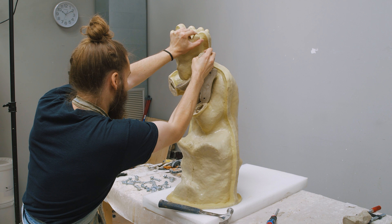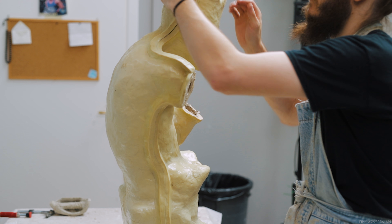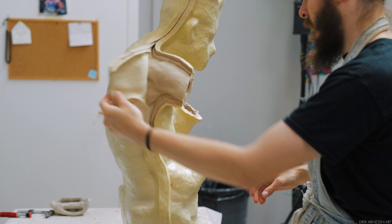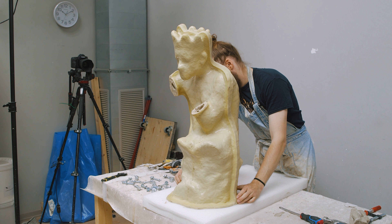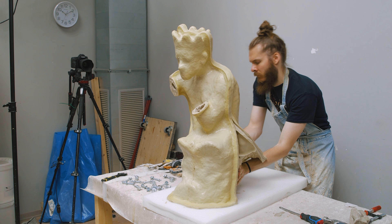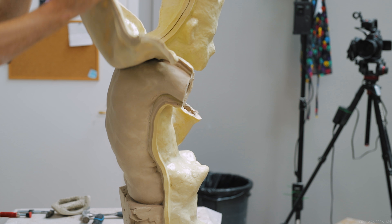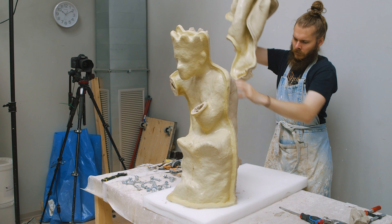You can see that when this last piece comes off, it breaks the arm a little bit. This is a slightly failed mold design on my part, but it's not going to be fatal. The part that breaks — and this has broken every time I've cast this piece — is a few centimeters on the inside of the left arm. It's really out of view, just a soft rounded form without too much information present, which makes it really easy to retouch later. We all make mistakes from time to time. When it comes to mold making, it's impossible not to. But the most important thing is taking note of the mistake and figuring out a way to correct it in the next mold, and ideally in the next casting of the same piece. There's always something you can do to get a better cast with less issues.